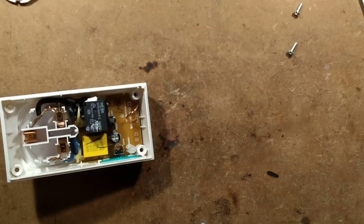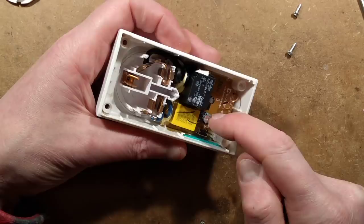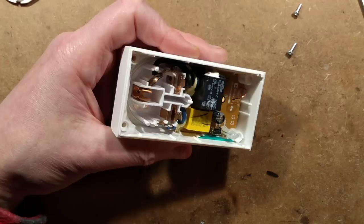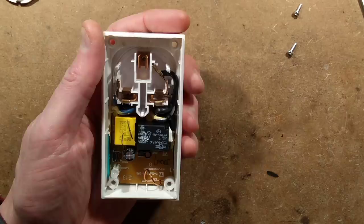47 nanofarad is the prime suspect. What's most likely been happening is that when you turn it on, it's got enough power to make the LEDs light - this LED here that lights up orange and blue. It's got enough power to charge the capacitor to the level that lights it, but when you click the button, the relay draws so much current that the capacitive dropper can't keep up. The capacitor slowly discharges until the relay just clunks back out again. I'm going to look for some capacitors and get the soldering iron on. Let's try and get the circuit board out first - I don't think it's screwed in, but I can see some glue, and I don't like things that are glued.